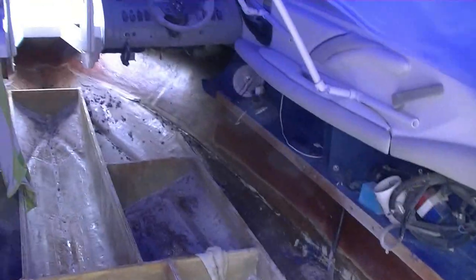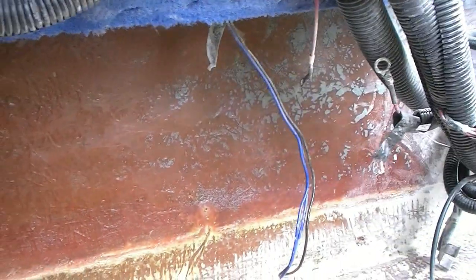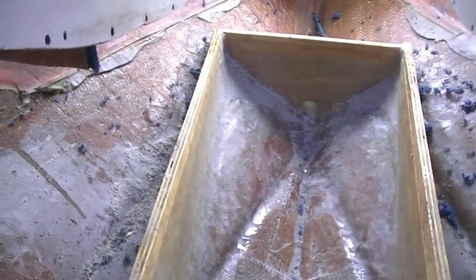Let's go look inside the boat and see just how clean it came out. You can see the side panel — the gray part is just gelcoat. The MEK took all of that carpet glue off. There are a couple of little spots here and there, but those are simple work with the grinder. See all the carpet remnants down there? Once MEK gets on it, within about a minute the carpet just brushes off, leaving a super clean surface that I can rough up with 36 grit and then make it happen. Really happy with the way it turned out.